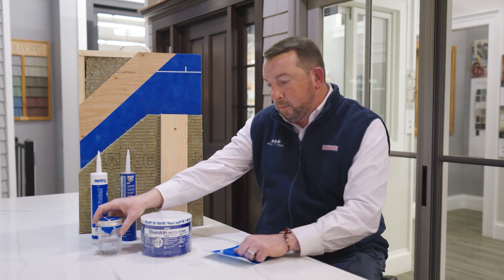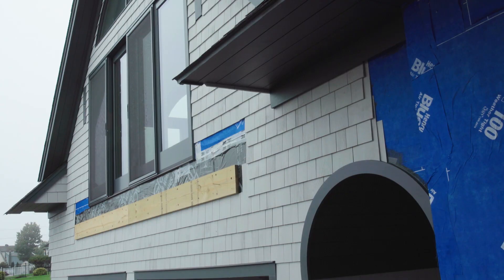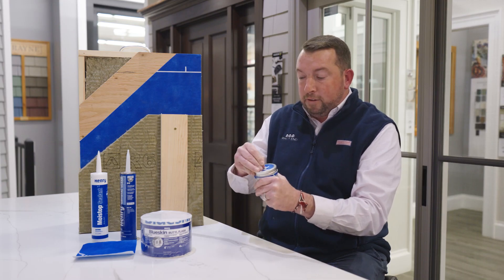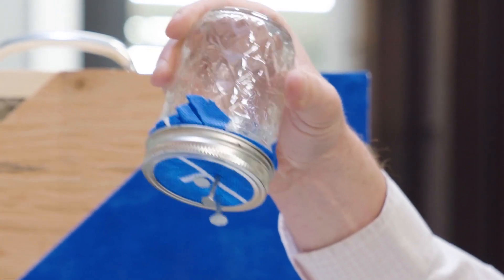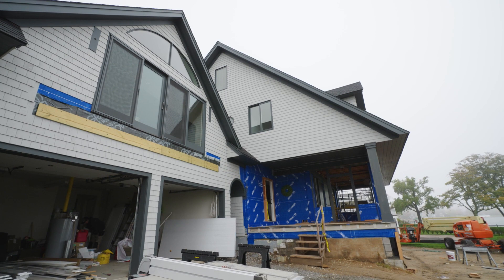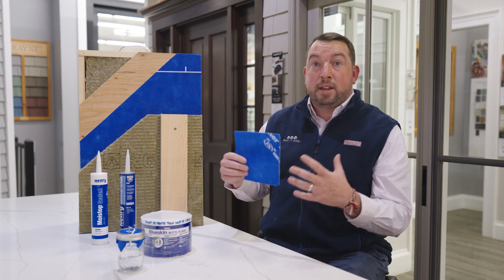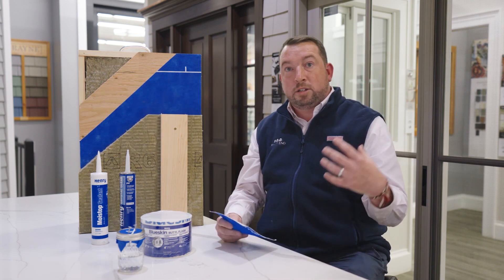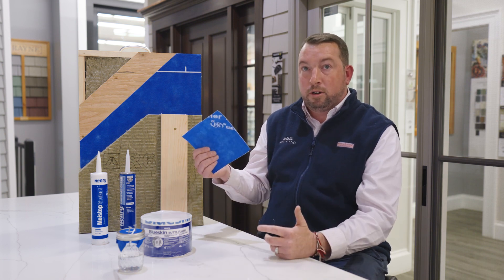One of the biggest things that people love about it — if we think about how we attach our cladding or siding products, we use nails or fasteners. With a fully adhered house wrap like Blueskin VP100, this creates a seal or gasket around every single fastener that we put through it. Unlike traditionally mechanically fastened wraps, there's no way for water to penetrate that barrier. The best way I like to describe Henry Blueskin VP100 is it's like wearing your Gore-Tex jacket on the outside of your home, blocking all the exterior wind-driven rain and snow.